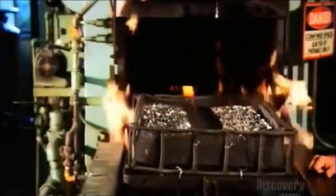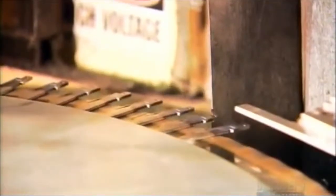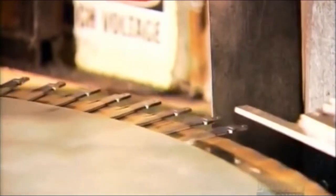A trip into a fiery furnace hardens the metal — it's the first step in heat-treating the blades. Once they're cool, an operator places blade shapes on the magnetized rim of a rotating carousel. It moves the base of the blades under an induction heating coil. The heat anneals that end, making it pliable enough to bend and easier to fit in the pocket knife handle.